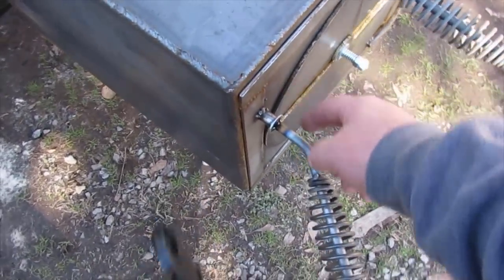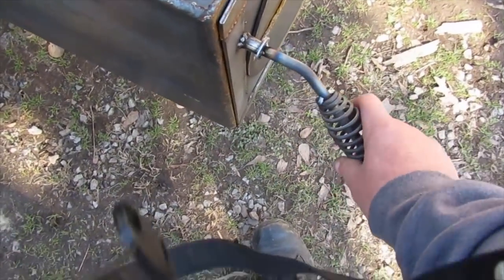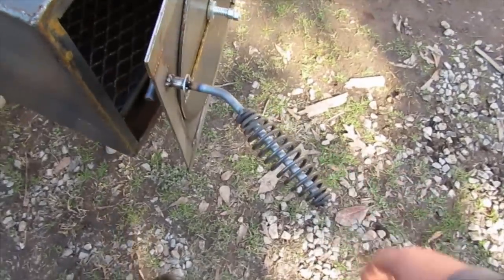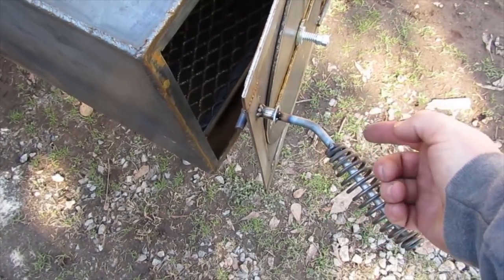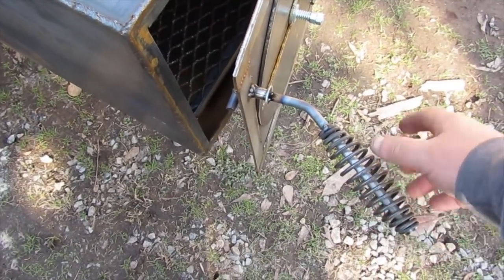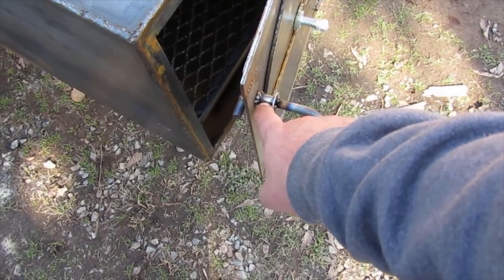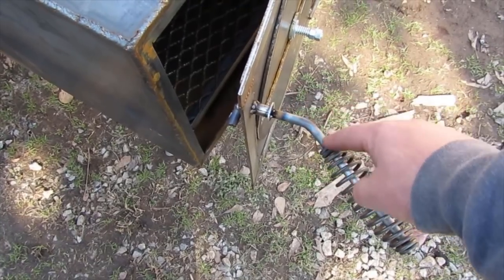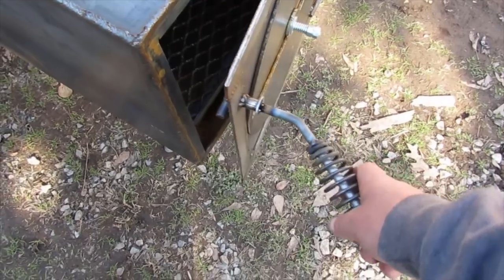So what I did was, instead of having this washer up next to here, which created slop in the whole thing, because my 3/8 hole that I drilled here, I guess just the width right there is just not enough. It didn't have enough support. It made it really floppy. But I added this 1/2-inch tube, which is 3/8 inside diameter, and it fits really tight against the rod. So I ran it through, and now I have no slop.